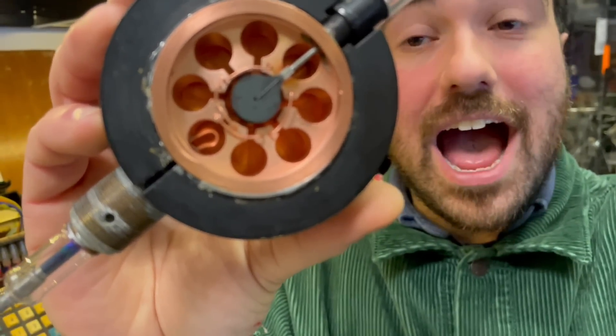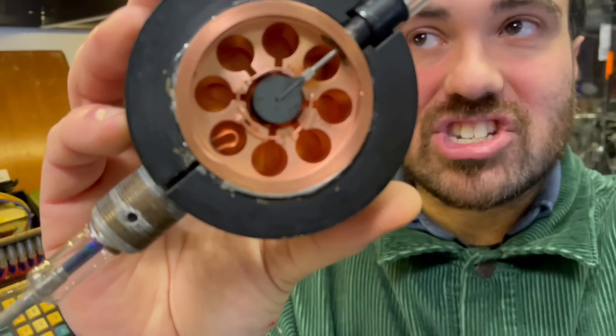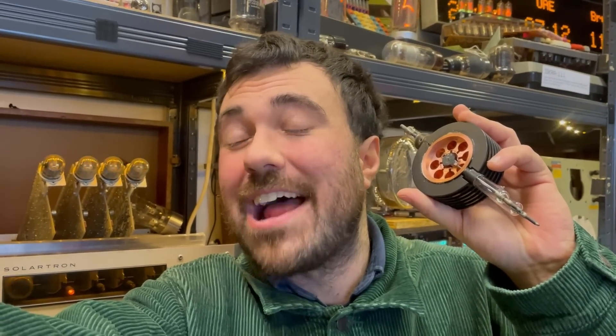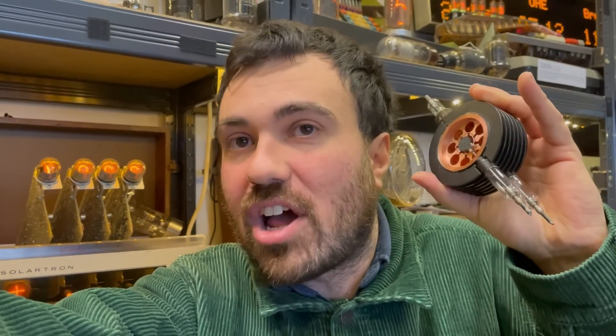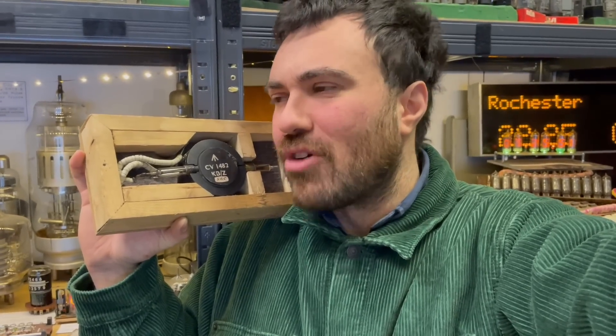The genius thing is that because of the cavities, it takes more time for those little charge fluctuations to even out — because the current has to flow around the cavities. You can actually tune the wavelength that this thing outputs by the size of those cavities. So because of that time delay and the random stream of electrons constantly smashing into the anode, their paths being deflected and influenced by the fluctuating currents and charges within the anode itself, you have this amazing spiraling, oscillating wave within this thing.